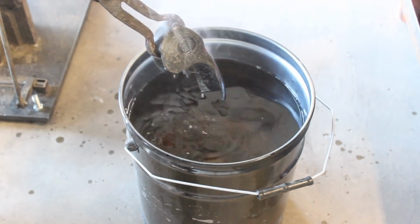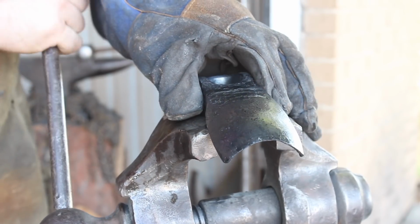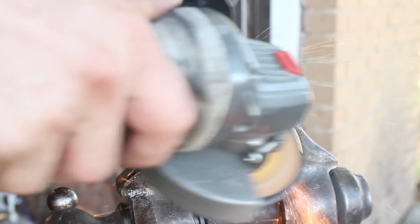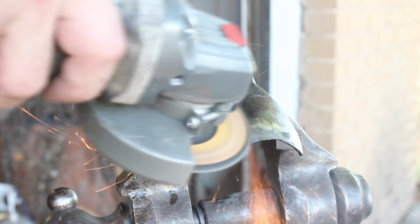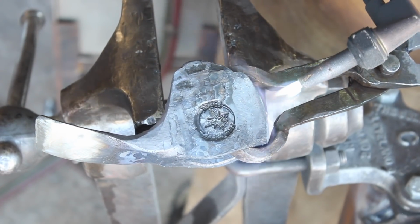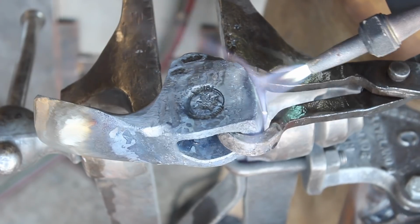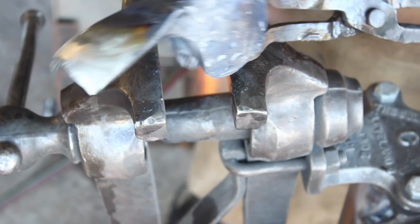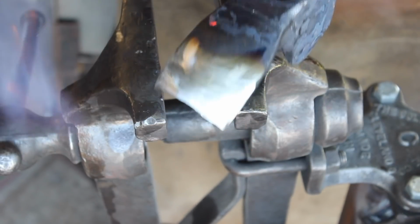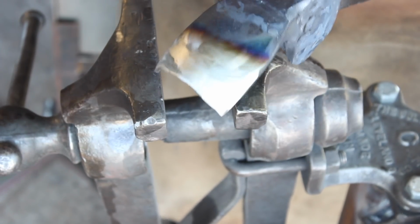So I went ahead and heat treated this in the forge and by hand with the acetylene torch. And I typically don't do that, but this of course is sort of a research and development project. So it really is fun to heat treat in the forge and temper by hand like this right here. It kind of gives you a little more hands-on feel to the project, and it produces just as good a tool, I think, if done properly, but it just takes a little more time and attention to detail. So if you're doing multiple pieces, it's not as practical.